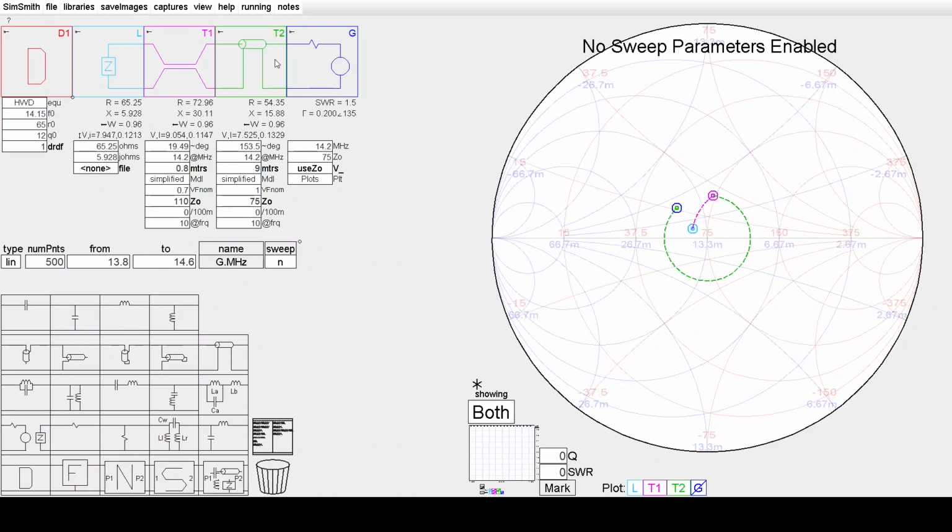Now you can do that with a VNA, changing the reference impedance, or an antenna analyzer that supports the same thing, or just a 75 ohm SWR meter, which is what I used 50 years ago when I started using this technique. So you make it a bit too long, adjust the dipole length to get 1.5 to 1 SWR on this 75 ohm section looking into it. Then you can measure the impedance and calculate how far to shorten this 9 metres.